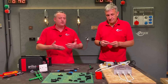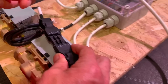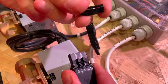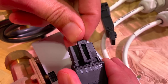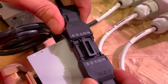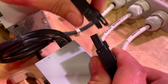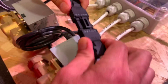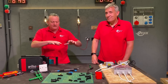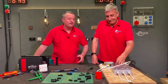You can also add a locking device to prevent people accidentally disconnecting them. You don't have to change the whole connector system — you just add a component. Here are the connectors from the mock-up; they're easy to pull apart. To make it a latching connector, just add this component, push it into the two ports at the top, click it in, bring the two connectors back together, and it's a latched system. To separate them, push down and lift the latch, then pull the two apart. With the latch it's held really securely — thinking about an airing cupboard where towels fall and people grab things, the latch prevents accidental disconnection from killing part of the central heating system.